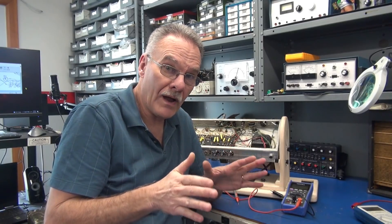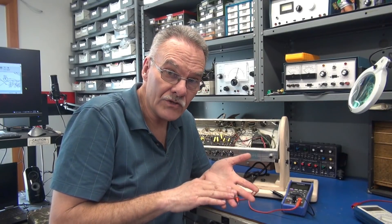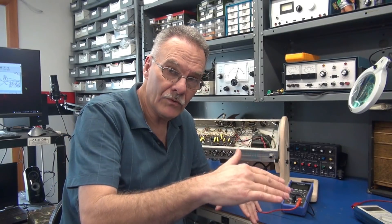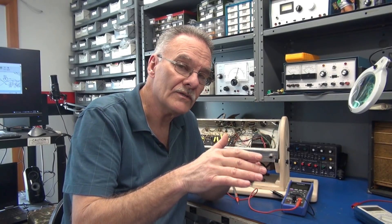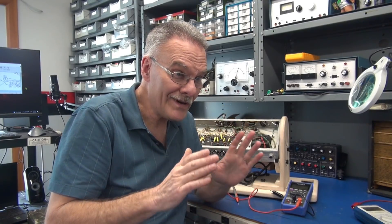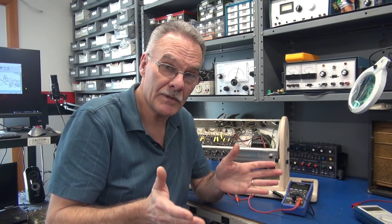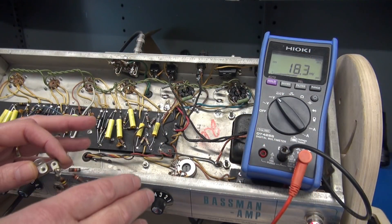The reason for this problem is not because of a power supply issue or a tube issue — it's technology. Back in the day when Fender designed these amps, line voltage was around 115 volts AC. Now it is up around 123 volts AC. So all the power supplies have increased, which threw the bias out on these tubes. It's a really good idea to be able to control the current through your output tubes so that you don't smoke them or wear them out too quickly, especially with the price of tubes these days.